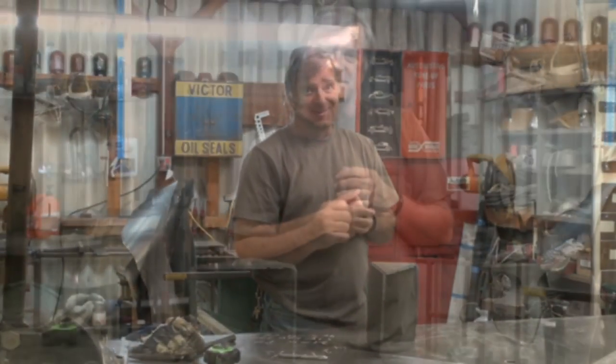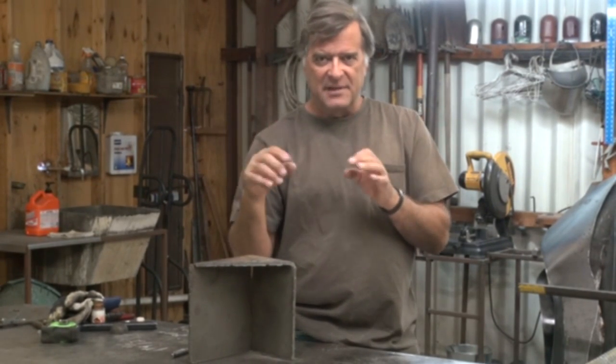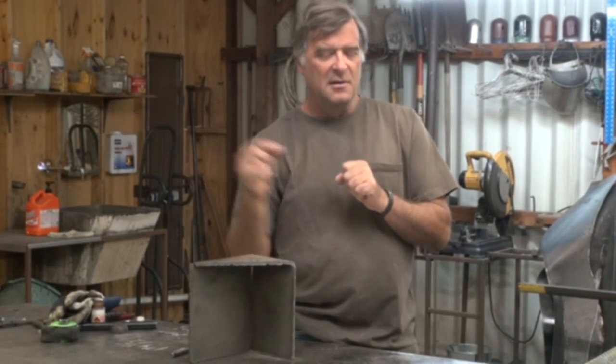No. You're actually pretty close on what you need for the kind of work that you want to do. Most of the TIG welders nowadays come with a stick welder — an arc welder built in. Or, to be correct, an SMAW — Shielded Metal Arc Welding. That gives you the capability of being able to use this machine in both places. You can use it inside or outside. All you have to do is switch from one process to the other.